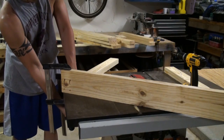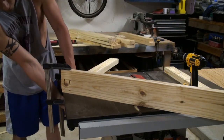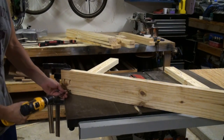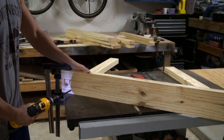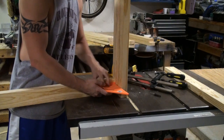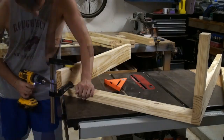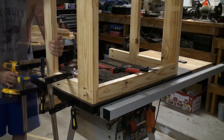In case you're wondering why I'm doing this on my table saw — I have workbench space, but they're not perfectly flat. This table saw is made out of cast iron and it's perfectly flat, so I can clamp these pieces of wood down and my joints are all going to be perfect. I'm going to repeat this process as we assemble the entire stand, clamping down pieces wood-to-wood and wood-to-table to get perfect joints that are tight and perfectly aligned. I'll check those joints with my triangle every time.